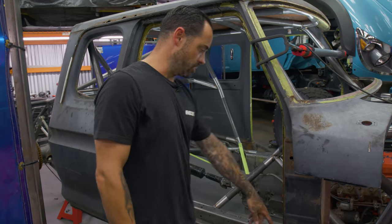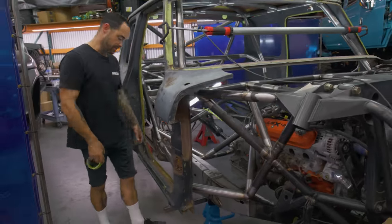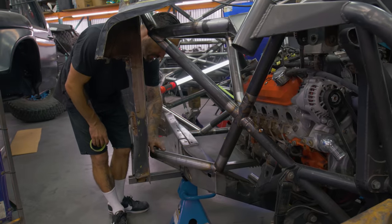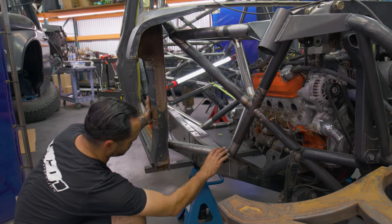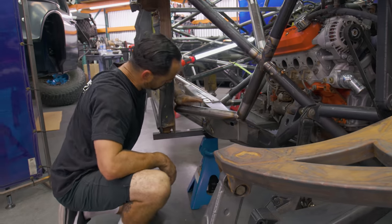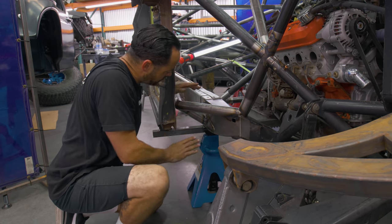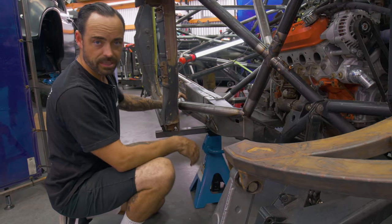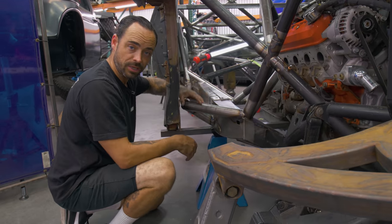We do have these runners coming out here. Again, this whole thing's built to be a slip body in a sense. So this whole section with also another mitered partition area here and landing down. One of the other things to stress with a lot of design, when a cage is being constructed, is not having the support tubes where the most impact is going to be pushing down on this thing. You really want to be able to disperse that in an angle and not like a tube just going straight across. It's just a crucial thing, so it's not just going to rip down because it'll just bend. So establishing this kind of pedestal here is where we're going to land a big junction.